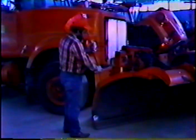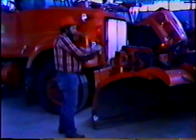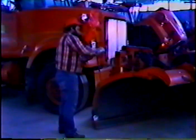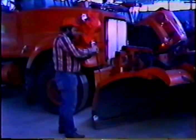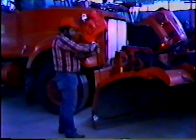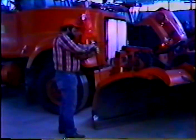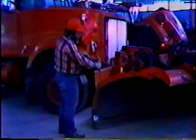One more thing about the plow, you can't see it from the cab, so make sure you put safety flags or cables like these in both ends of the plow, so you know where the edges are. If you still can't see the edge of the plow, try wiring a flag to the cable. Plowing is a hard enough job when you can see the edge. You don't need to make it any harder.